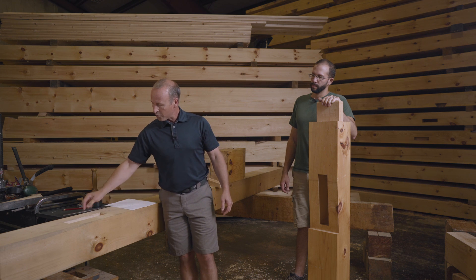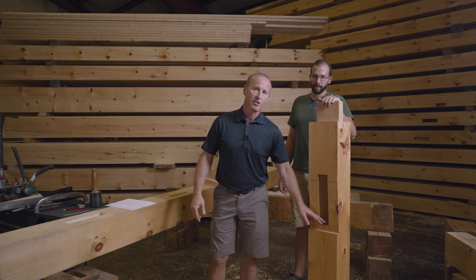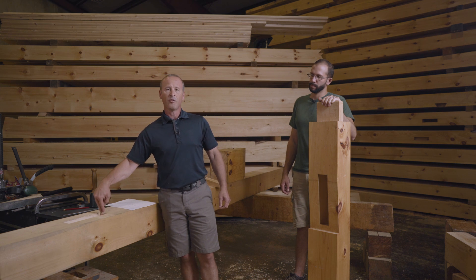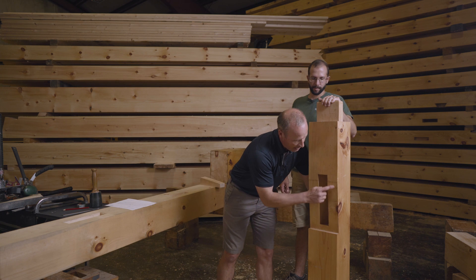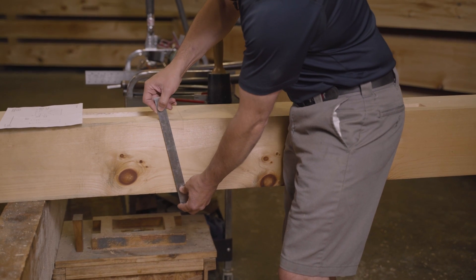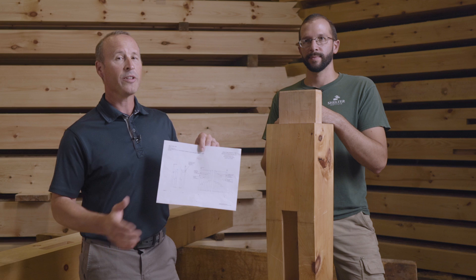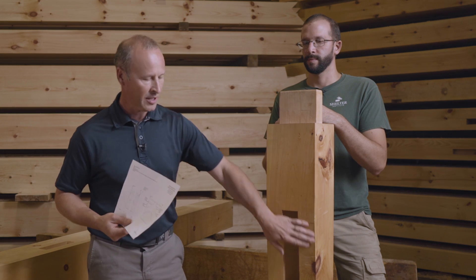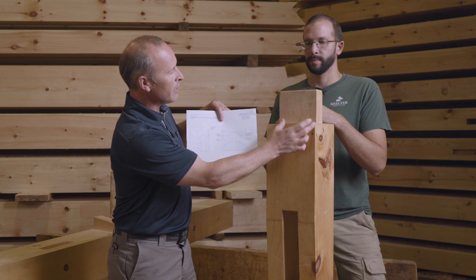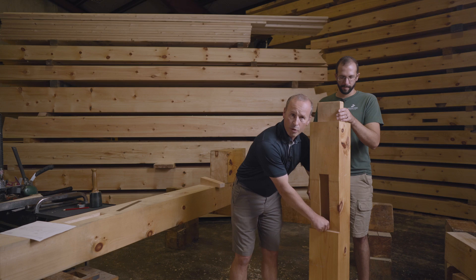If you cut the taper on the side of the post first, this important elevation mark goes away and it's very difficult to get back, because now you're into the post — it's no longer actually 111 and a half inches above the bottom of the post. So make sure you cut the mortise bottom taper first, from 111 and a half down to 110, and cut the side taper last. Inside the post it's going to look like 111 and a half on one side and 110 on the other. Note that our model looks different from your cut sheet — don't let that confuse you, this is a generic model illustrating the mortise. On post one the tenon is all the way to the right, whereas on this model it's centered. Gabe is now going to finish the mortise following that order: the bottom taper first and then the shelf cut second.